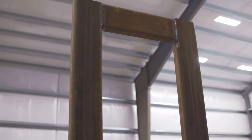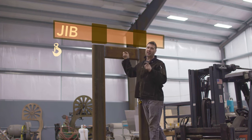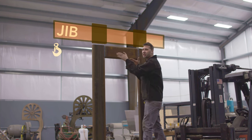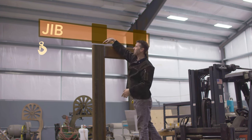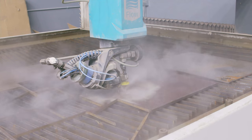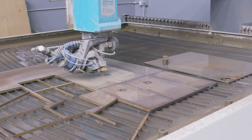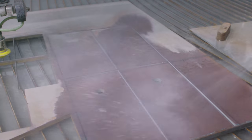The next step was going to be welding the jib portion on top of this mast, but I've decided to make the jib adjustable instead — it's going to slide like a piece of receiver tubing on top of some straps that I'll weld on. I'm making the straps out of some half-inch plate; the water jet is going to slice them up into the eight-inch-wide pieces I need, though I could have also used some eight-inch flat bar if I had it.